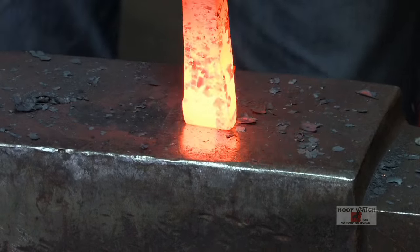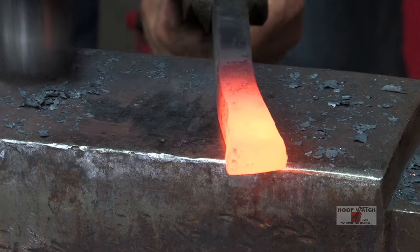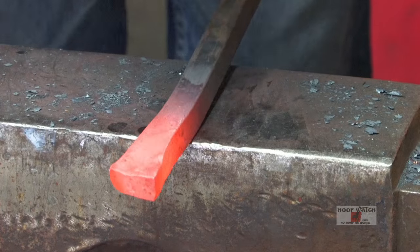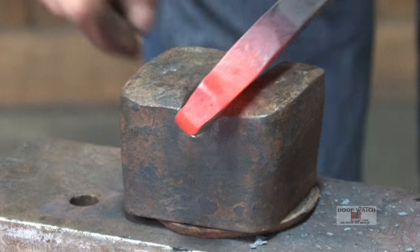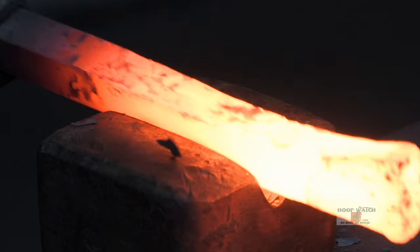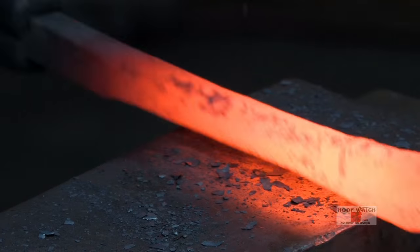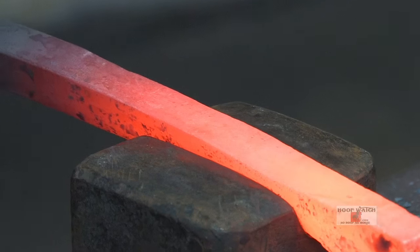If you just hold it at an angle, you can get a little bit of the heel angle on it already. Kind of just bring it back a little bit. We've got way more than enough, but what I'm trying to do is make the transition so we don't put so many dents and notches; I can put it all the way to the end. Basically I'm just pushing all my flashing back in. Come on to the edge. There you go. Perfect.